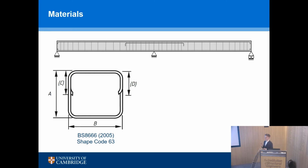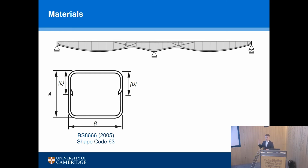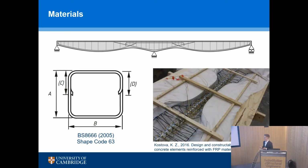And particularly, if we're going to start making unusual shapes, then why not make advantage of the fact that your carbon fiber starts its life as a really flexible material. It's just like a cotton or anything that is woven. And we can use that as our advantage in the material. Even when it's covered in resin and it's wet, that is still a flexible piece of material because the resin takes a few hours or a few days to cure. And so we can start to think about this in a completely different way.